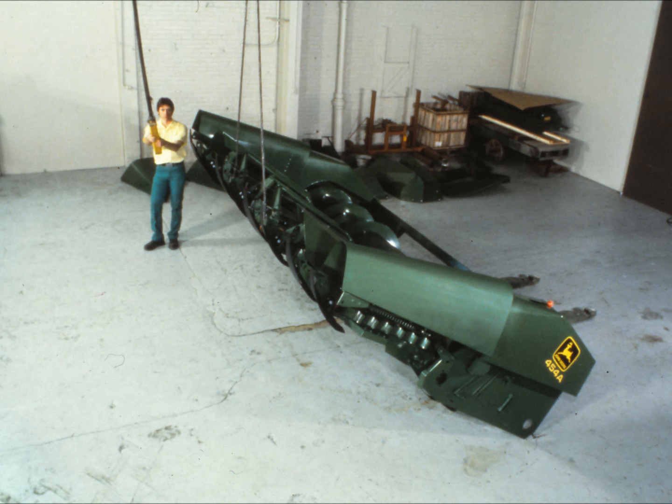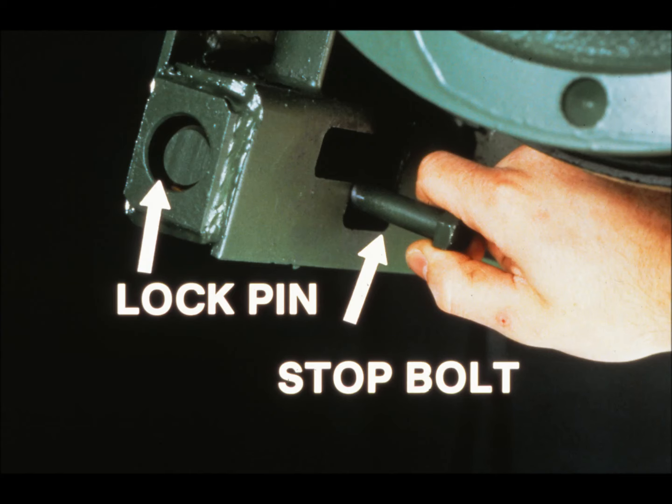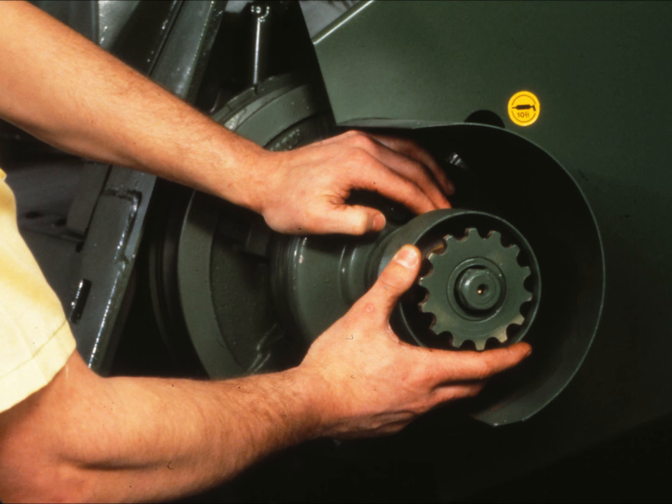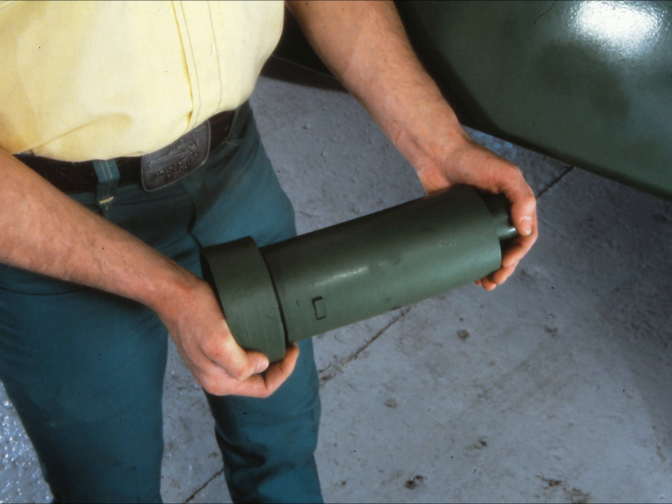You're now ready to roll the head into its operating position by lowering it down and forward to the ground. Then remove the chain or sling and the shipping channel. You are now ready to attach the head to the feeder house. First, make sure that the feeder house lock pins are in. You do this by pivoting and sliding the stop bolt. These must be in or the feeder house may be damaged as it is attached. The quick couplers also must be in. The models 453 and 454 four-row heads have just one quick coupler located on the right side — it too must be in. If the head is to be used on an 8820 combine, the coupler that comes with the combine must be attached to the left-hand header shaft, replacing the coupler sprocket on that side.